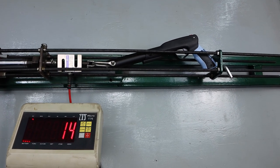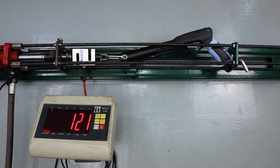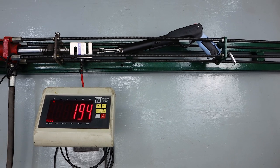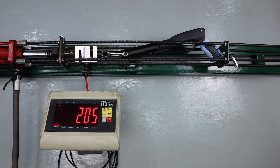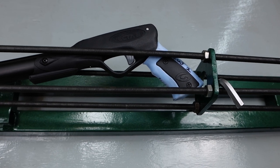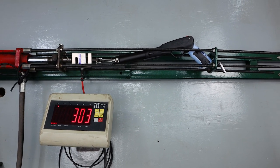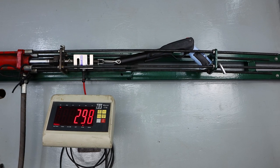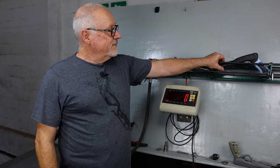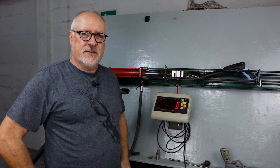Remembering we had 280 on the last lot. Everything's changed up to be in tension instead of thrust. Blocking my eyes just in case. I'm expecting it to handle at least 200. Past 230... getting tight... 240... and we've passed the old record. It's over 300 — I'm not going to break it, things get quite airborne. Take the pressure off. So as confirmed, the supplier was right — this is a better material, getting over 300 and it didn't even break.